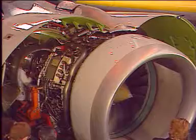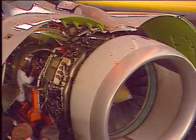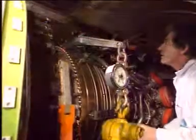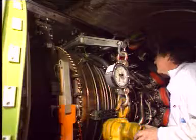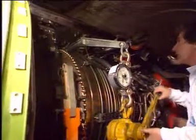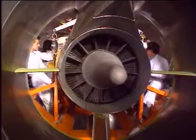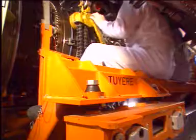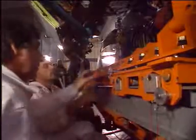Make sure that no lines or unions remain connected to the pylon and lower the engine using the 4 chain pulley blocks. Also check that the engine mounts disengage correctly from their attaches. Slowly continue the descent until the cradle touches the trolley. Then secure and lock it.